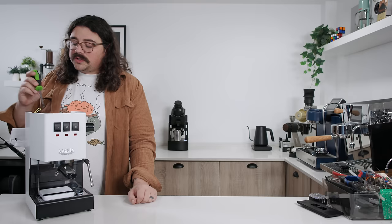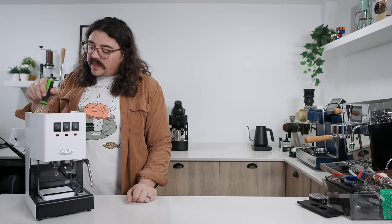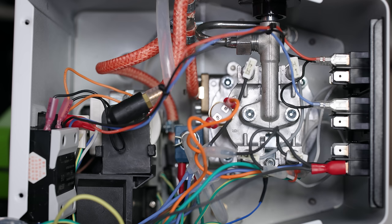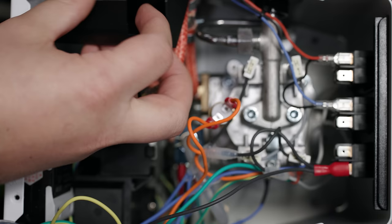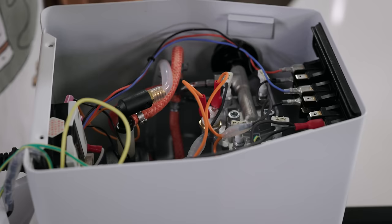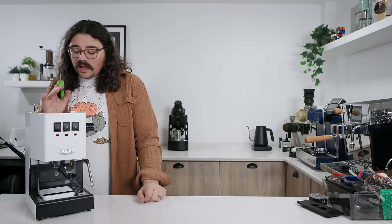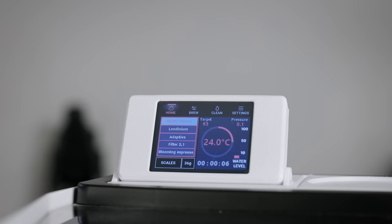The SSR allows you to heat up the machine. Inside the original casing is where the first PCB board was. I had to take that out and put in the new board — it looks similar to the old one, just a bit more fancy. You'll see a 3D printed case right here where people store their motherboard when they don't have the casing. I reused that empty space in the Eco's casing to save space inside the machine. I also added a T-splitter to the water tube just to avoid having two tubes going in — a simple hack you can use on your Gaggia regardless. Another modification that runs to the motherboard is a water fill sensor, just under here.